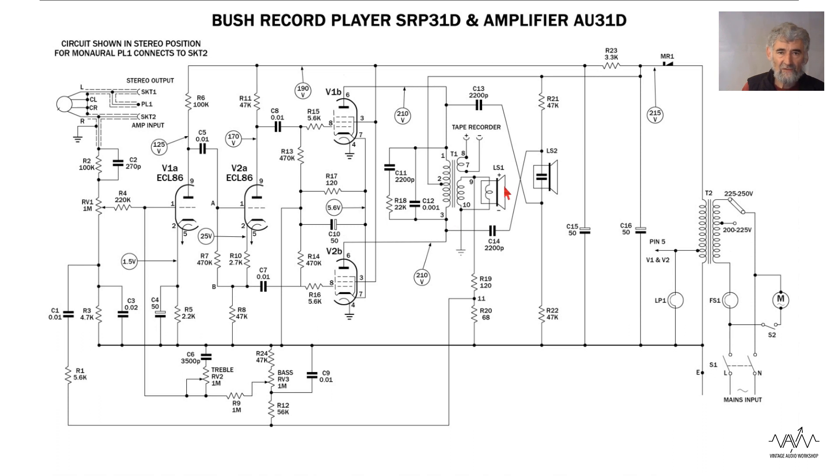There is our speaker, and you'll notice something going on here. This is an electrostatic tweeter — it's driven through capacitors across the anodes of the output valves. There is a constant DC bias on it provided through a resistor, with the other side going to earth. Those resistors have a high impedance compared to the anode impedance, so it doesn't see much of a load through the resistors. The tweeter consumes very little power but does require quite a lot of volts.